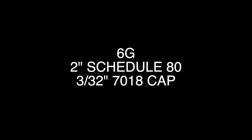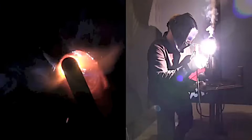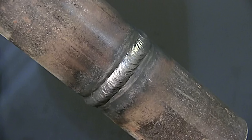Another common test is a 2-inch schedule 80 with a 3/32 6010 root and 7018 fill and cap — this shows just the cap. This was the first test I ever took and the first test I ever failed — wasn't the last one I failed, but many years later I got to film this video with my good friend Andrew Carden. If you are a welding instructor, I hope this helps and I hope you'll click the link in the description and connect with me — let's see if I can help.